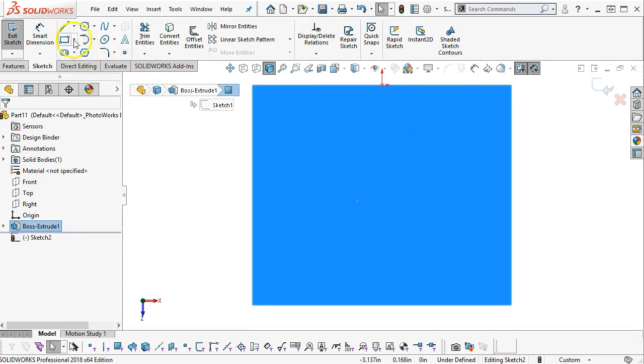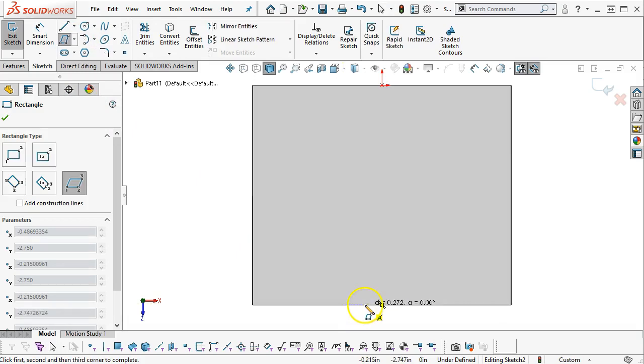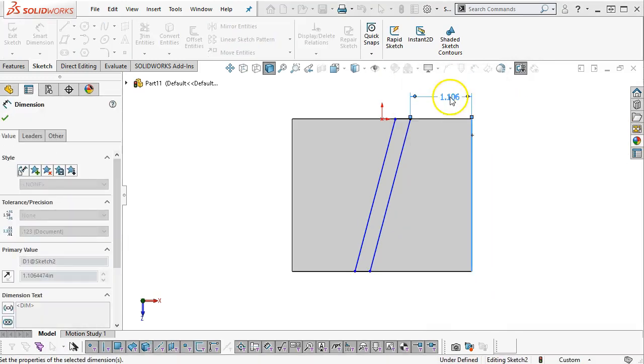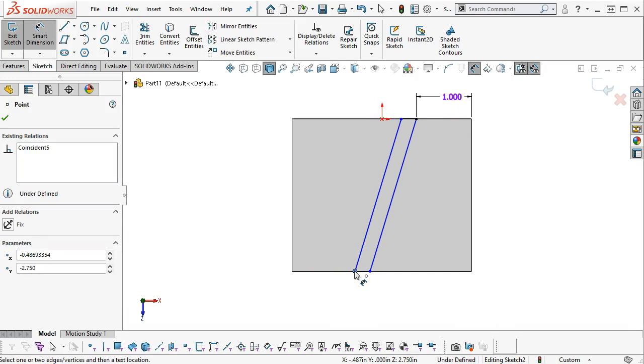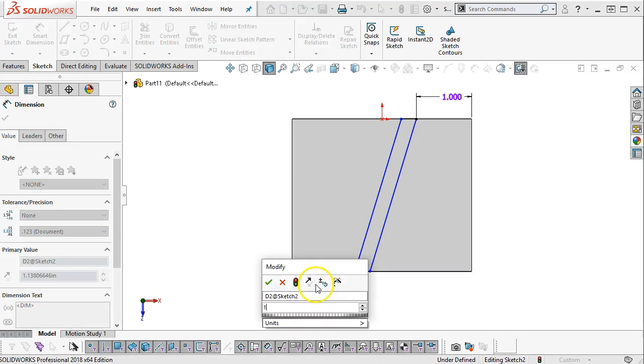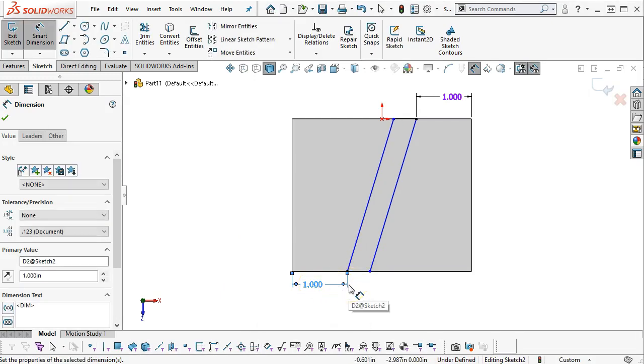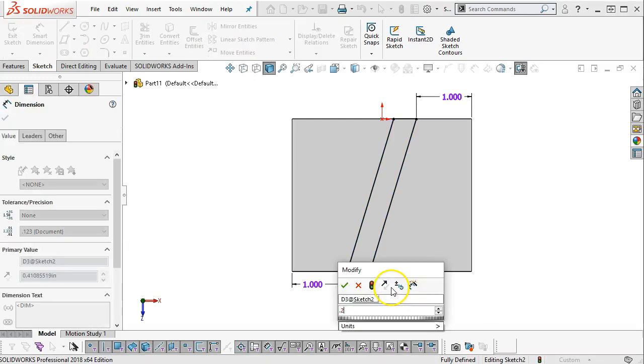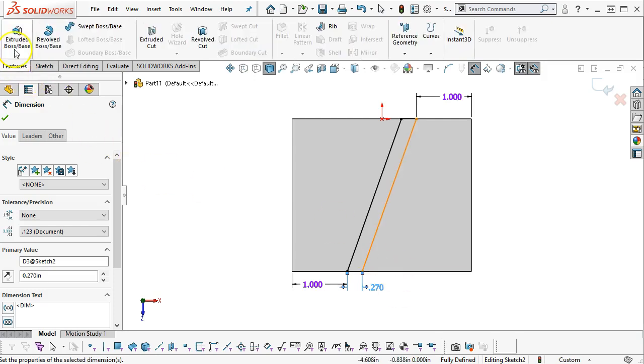All right, we'll set the sketch for the top, and then we'll go to parallelogram, since it will let us drag off at kind of the weird angle and still end up with our geometry. So 1 inch on the back, 1 inch on the front, and then the width references 0.27, but we're not given anything as far as a depth, so I don't think that 0.27 should be referenced. It's pretty much the thickness of the web. So, all right, and then the height is 1.5.